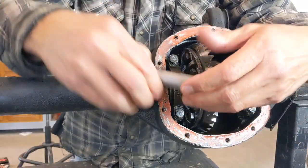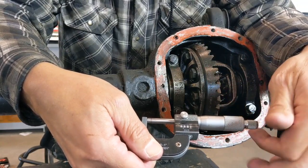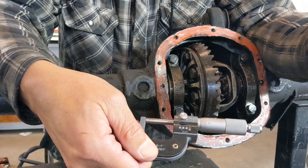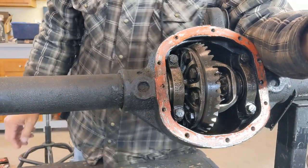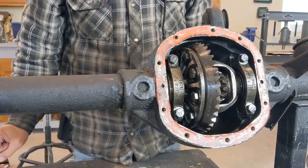Now the analog one has the same thing. The big one here does the big tightening, and then as you get closer, you get to this one here, and it starts ratcheting. That's as tight as you want to go, and that will give you an accurate measurement consistently. Let's move on to the beam style torque wrench.